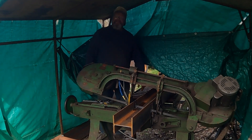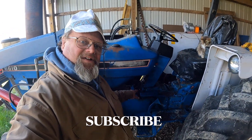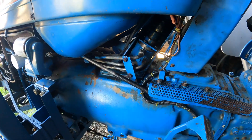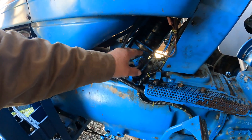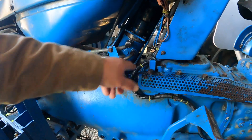At the end of the season last year, baling hay went okay, but the power steering motor on this tractor — you can see it right here at the bottom of the column — the pump brings oil in here and lets you turn left and right. It was leaking up here and down there. I decided to tear it down and start working on it. I'll show a little bit of the pieces I worked on, though I'm not going to go through the whole thing. If anybody has a deal like this, it's worth having someone who works on them help out. I got it back together and I'll show you what I did.